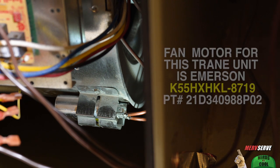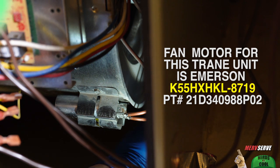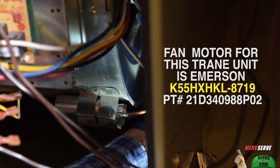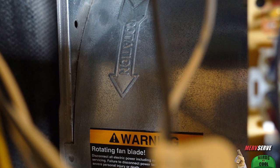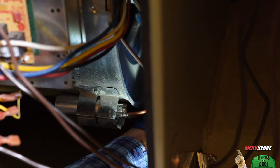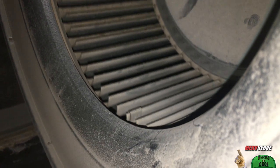Back at the air handler, power is off, and we're going to talk about the fan motor. I do a simple physical inspection first by reaching up inside to see if she's bound up. The fins are sharp, but I can carefully give her a spin. You can see the direction of rotation right here on the drum, plus a warning label that should not be ignored. She spins smooth — no physical obstructions, seems to be balanced good.